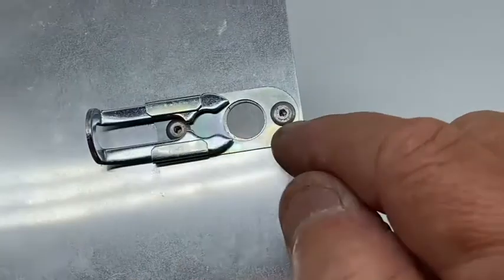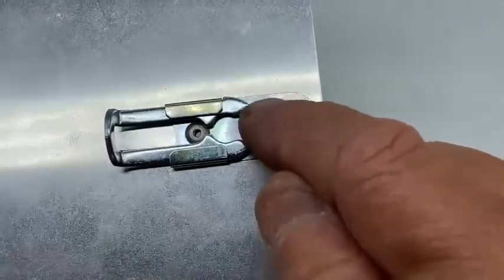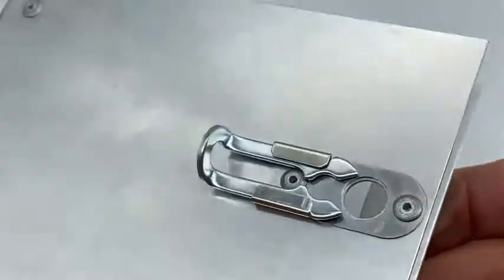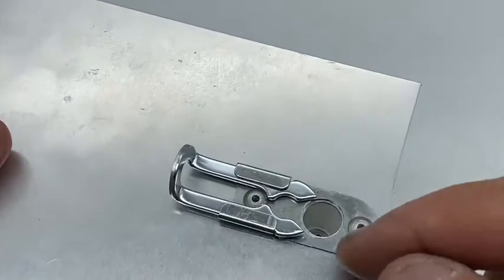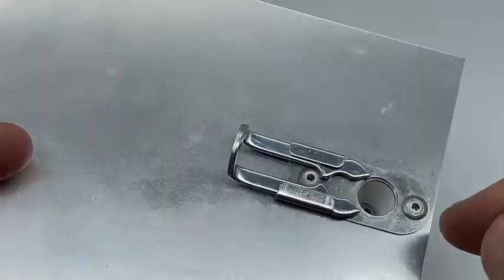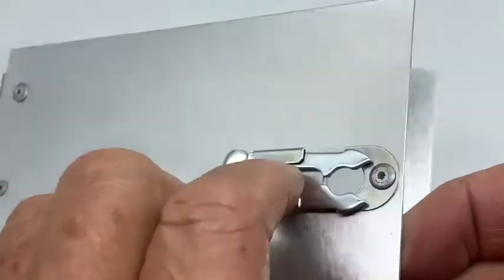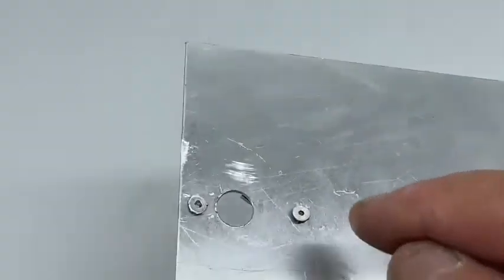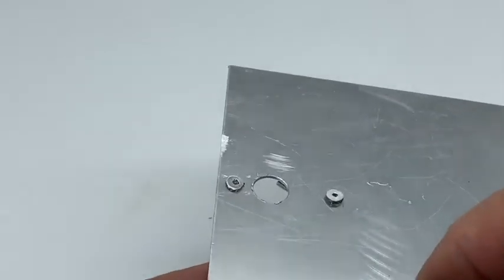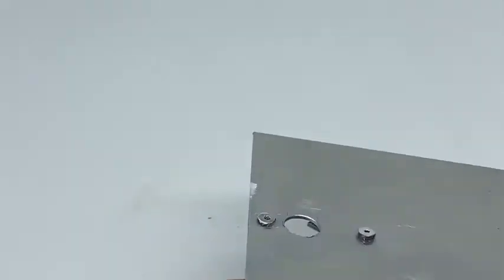This is fixed with two M3 rivets and has a through hole of 10mm. After riveting the top panel to the door, I took the stalk of the rivet and knocked out the two pins from above. Then I ground away most of the rivet behind the door panel and hammered what was left of the studs flat.